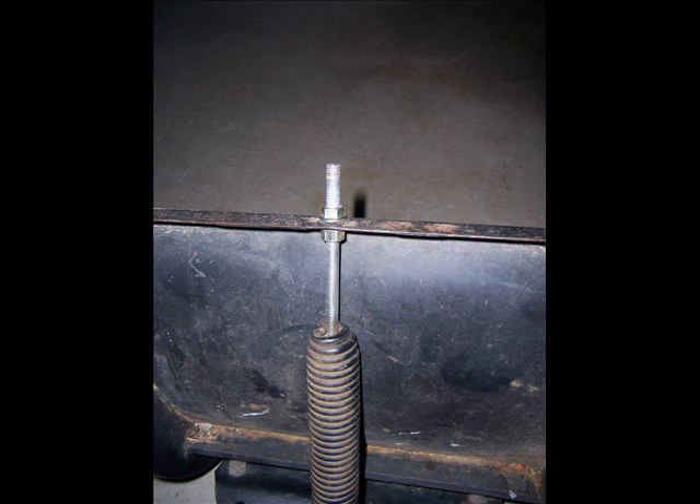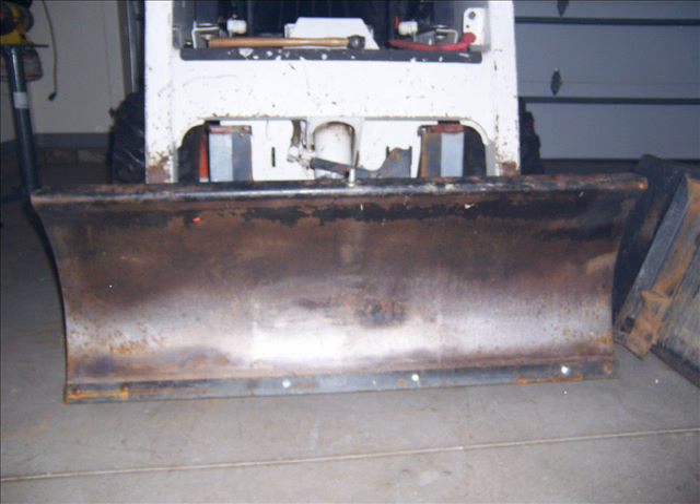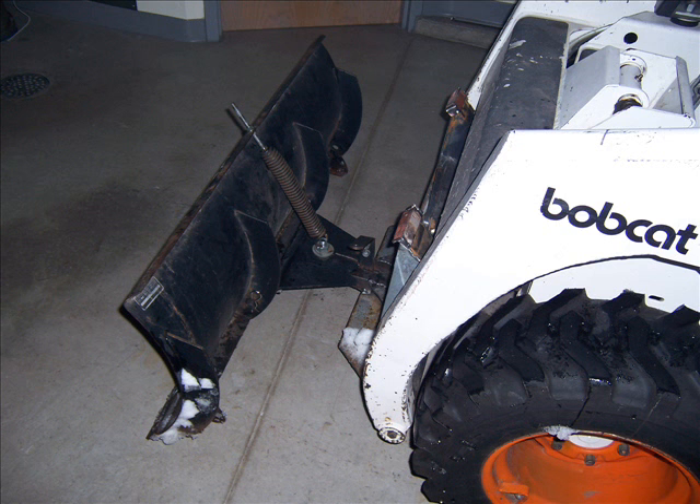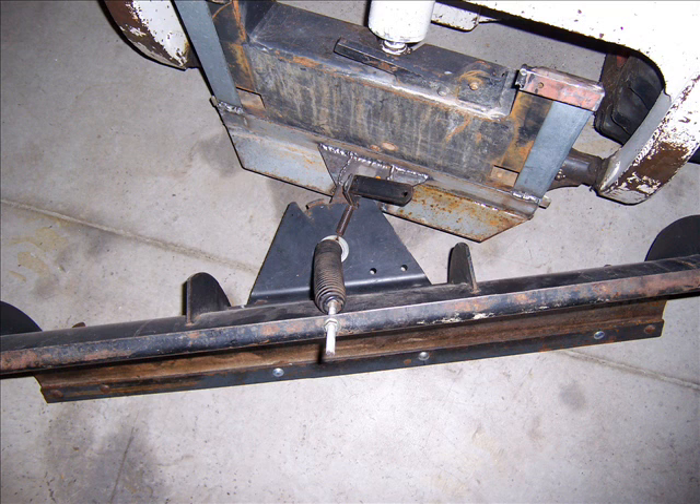I tightened it down pretty tight so there's a lot of spring tension. In the video you can see me make an attempt to pop the blade and watch the bobcat shoot up in the air. Here's the blade pulled back against the spring right against the stops — you can adjust these stops to control the angle of the blade. We're all put together and here's a photo of the blade on the bobcat. It's wide enough so that the bobcat fits within the path that the blade plows. Here's the back side of the blade. Then I tilted the blade 45 degrees left and 45 degrees right while it was on the tractor. Fortunately it snowed today, so the video that follows is actual testing of this blade. It works fairly well.